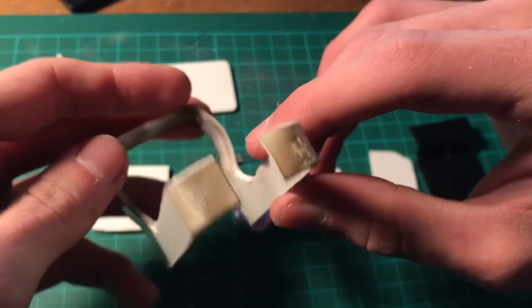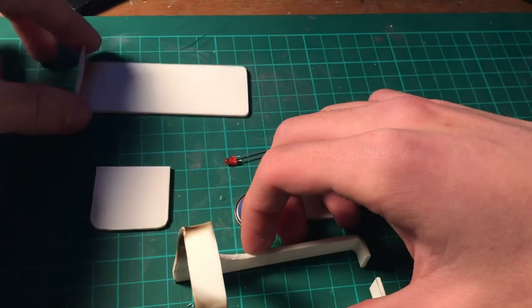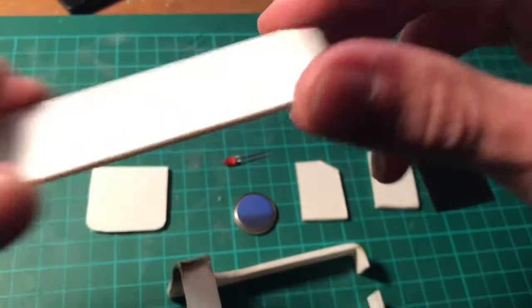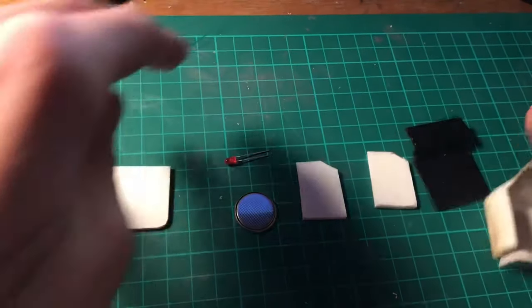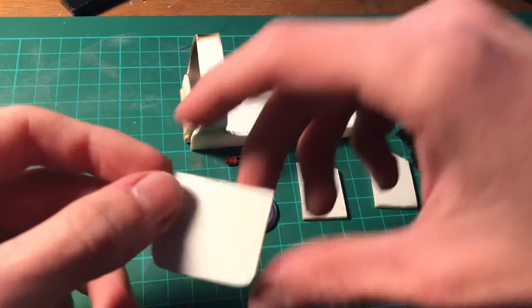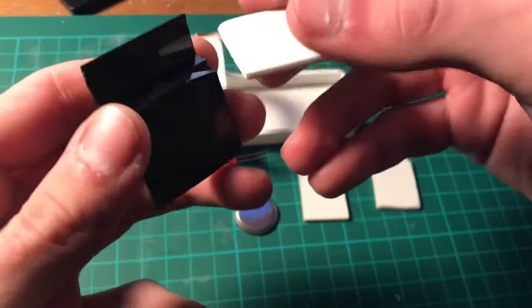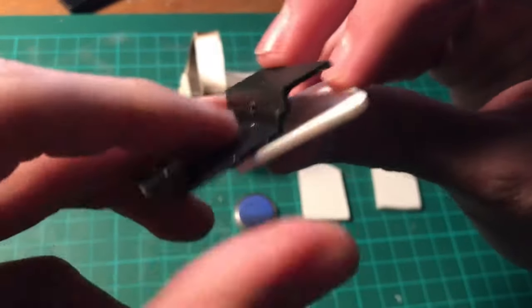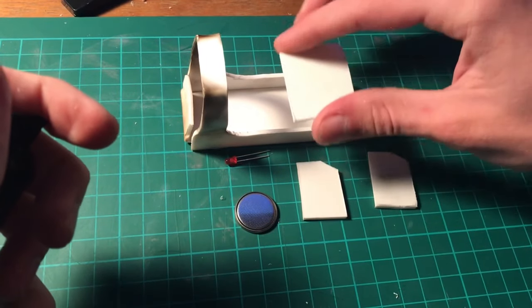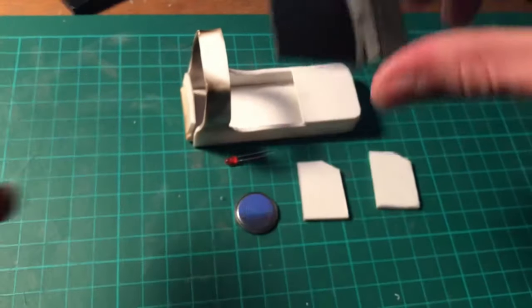On the main shape, I've decided to curve the little things at the very back to make the sight shorter and look better. This little bottom part I also decided to add a little front to so that it matches the whole shape of the sight. I also made a couple of additional plastic bits. This piece, for example, will go with the plastic part that we've drilled into — it will be stuck to the bottom to hold the LED into the centering hole. This piece goes to the back of the sight, and the LED is going to be resting on top of it with the battery.